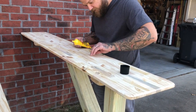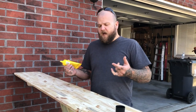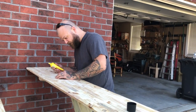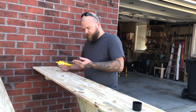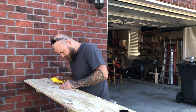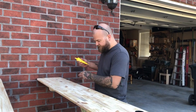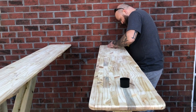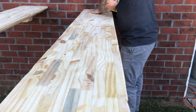Since it's getting painted, I'd like this surface to be as flat as possible. I'm going to apply the wood filler, give it a few minutes to dry, then go back and hit all the holes again — because the filler is going to shrink into itself a little, and I want it slightly proud of the wood so I can sand it back down to flush. This is a fun experience because I work more obsessively than Josh does, and he's called me out on a few things, which is healthy — otherwise I'll get carried away making everything super perfect.